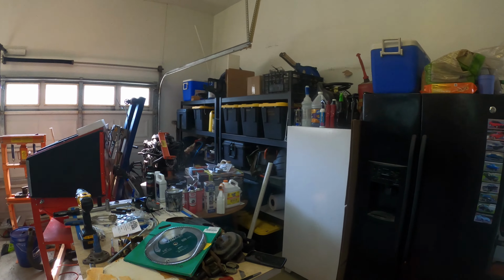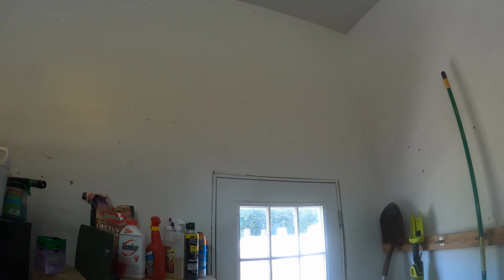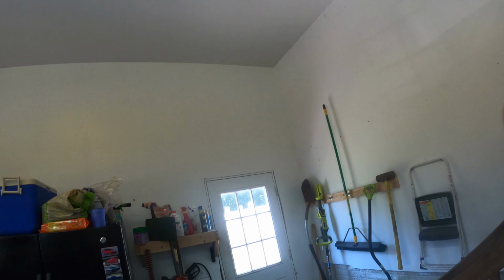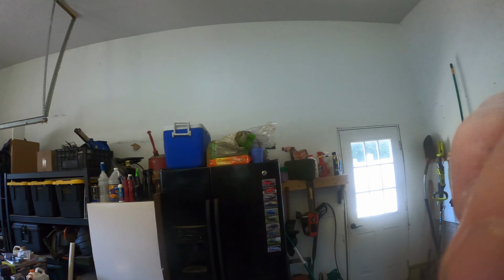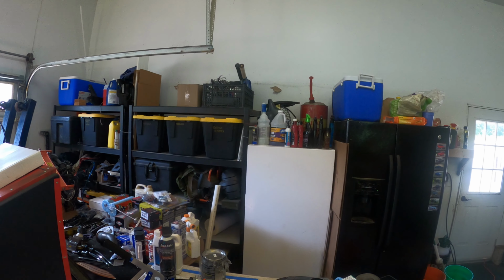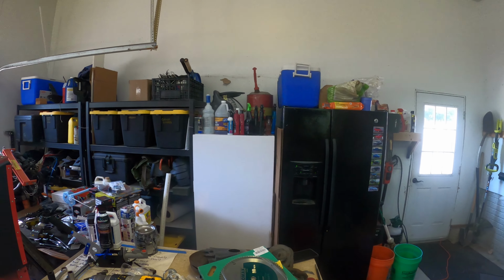And then maybe this weekend I really want to do that shelf. So it would be door height, right? Just wood, and then make it come out. If it comes out where those shelves are, which is all it needs to do, it's about here. Like, that's not going to be in the way, not that badly. And I don't want to have any kind of fold up part. But if I do either 2x10 or maybe even 2x12 for that span, right? And then a post right at the other side of the freezer there, because I think that's about the center. It's closer to the center than this side of the freezer, but we'll double check because we can always bump it over a little tiny bit.